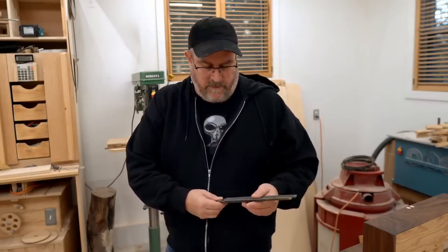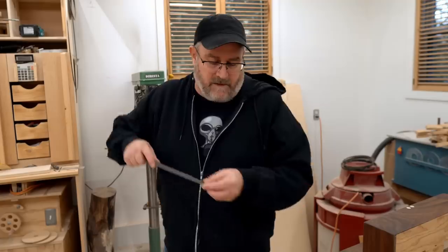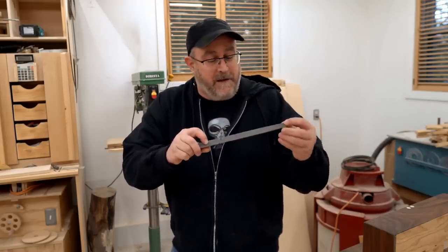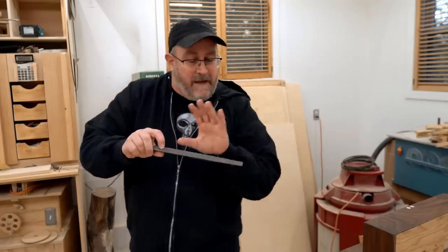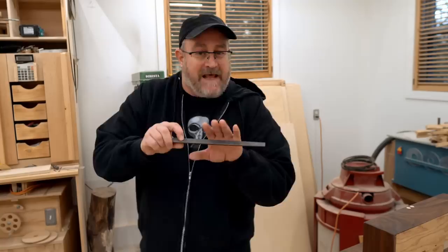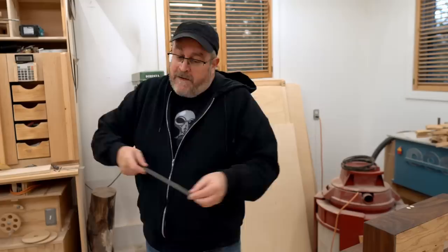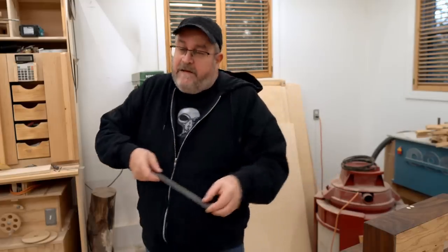You have to go back to when I was doing metalworking projects a bit more frequently, where I would actually use a file. Because whenever you use a file, unless you're using it textbook perfect — stroking full length, right from tip to heel — don't do it right in the middle. You'll get a million critiques of that too. Has to go right tip to heel, forward only, lift, forward only, lift. Unless you're doing that, you're going to get a bunch of people criticizing your use of the file.